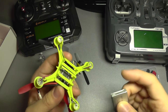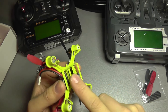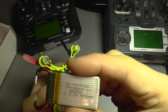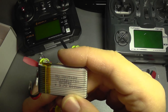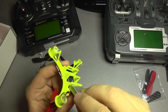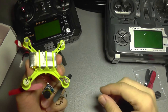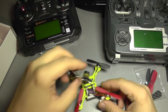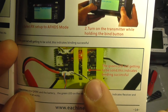The C version uses a plastic frame and has a battery cage underneath, so you don't have to rubber band the battery like on other models. It's a one-cell battery, 600 milliamps, with no discharge rate printed and no voltage protection — it's a standard LiPo. It's very easy to swap: you just put it underneath and you're ready to go.